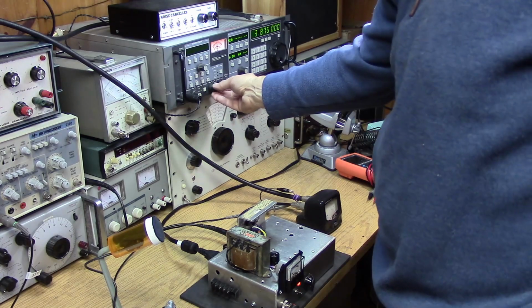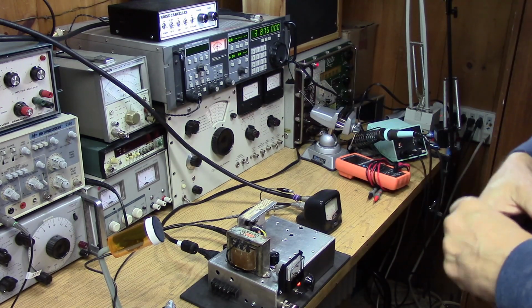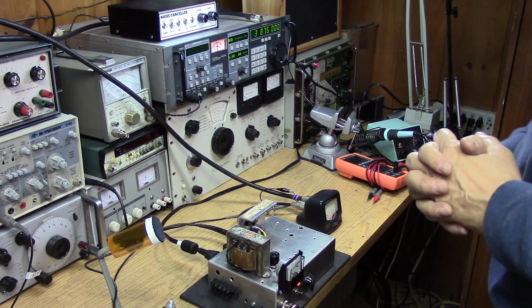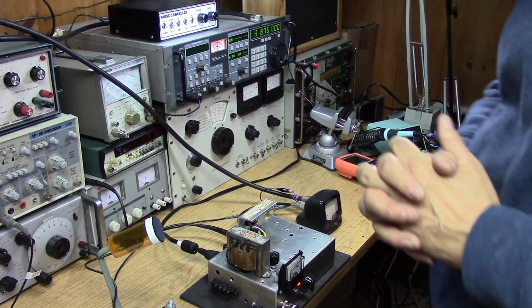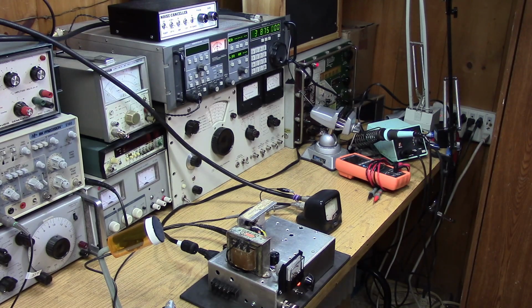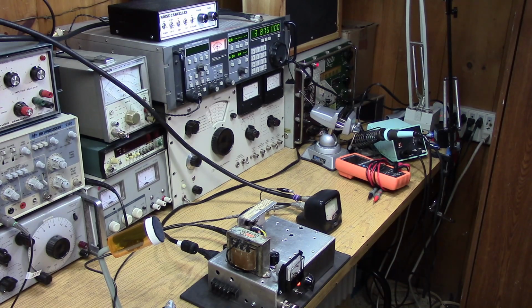Hey, Mike, I got most of that. You could use a little more audio on your transmitter, but that's really excellent. You've got the IRF630s working for their supper in PDM as well as RF mode. So yeah, if you can get a little more audio on the carrier, that would be good.